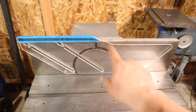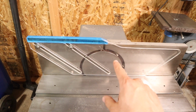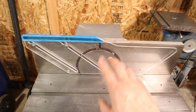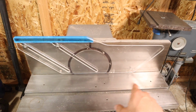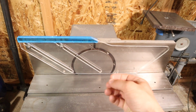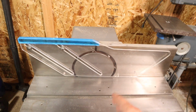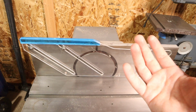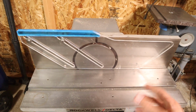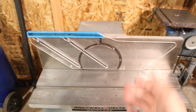So one of the other advantages to having cutter heads like this, rather than the wheel that you would get on a normal jointer, is that you can actually cut end grain with this. You can cut end grain partially because of the cutter heads and the way that they're working, where they more scrape off the wood on your workpiece, but you can also do it because you have enough stability to move your end grain through here. That's one of the things that you can't traditionally do on a jointer, because you'll end up just tearing into your piece and actually tearing it apart, and you generally can't get enough stability when you're trying to work on end because your workpiece is too tall. Whereas in this case, it's a little bit easier to get the play on it or the leverage on it so that you can cut the end grain, and it's super, super cool. In fact, in the original manual, they actually advertise that it's safe to cut a match head on this.